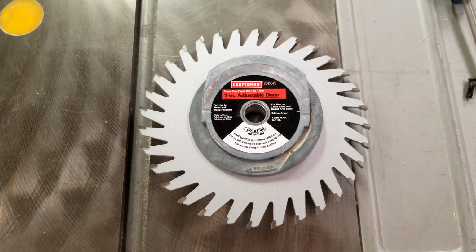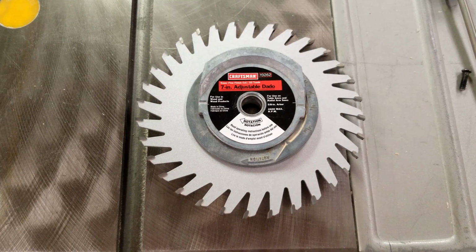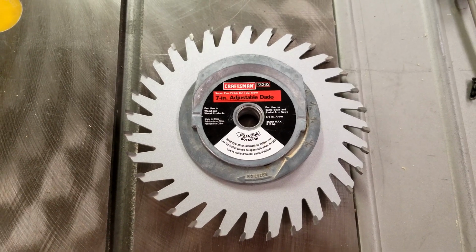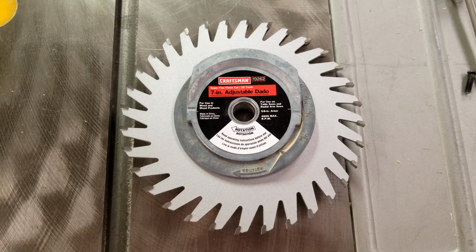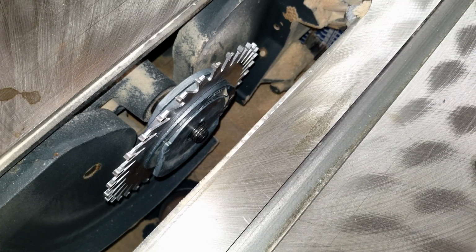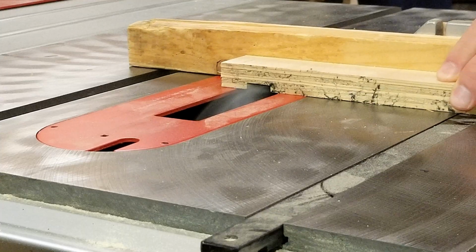The plywood, like many plywoods nowadays, isn't really 3/4 inch. It's just a little bit under, so I'll set the cutting width a little bit under, and then as usual I'll take some scrap material and use trial and error until I get it to a nice snug fit. You can see with the dado down on the arbor, there's not much room for the arbor washer, so I have to put just the arbor nut back on by itself.